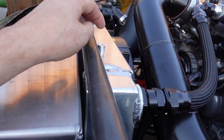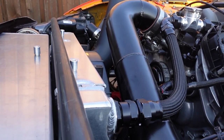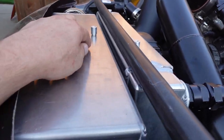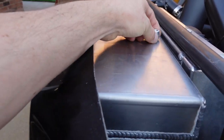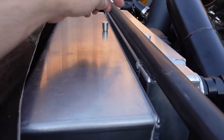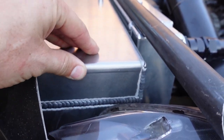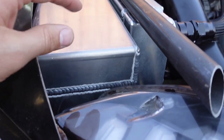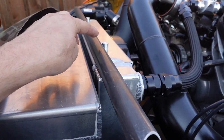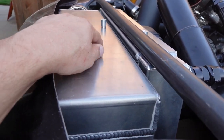That'll get these two mounted and keep the bar removable — it's not permanent. You can unbolt it on the side and the whole bar removes so it's out of the way. For the intercooler, we're not as fond of having a big mount ear. But the turbo and piping holds the intercooler really well, so I'm not as worried about that. The radiator is the main point, and this is going to be our upper radiator mount.